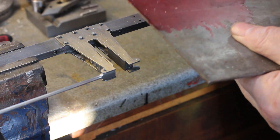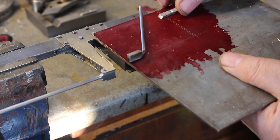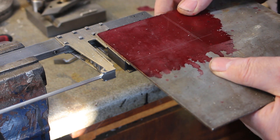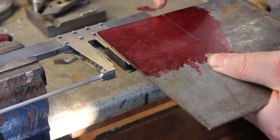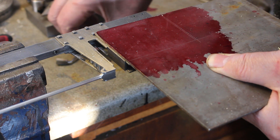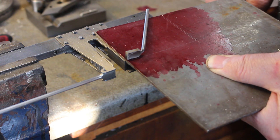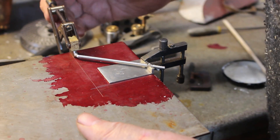To get in the right position for these components, I've just marked off this plate, which is basically the space — this rectangle here, which includes the buffer beam at the back. I can clamp this in place and use these lines to get it just about right, and then silver solder it. Okay, so ready there for silver soldering, nicely clamped in position.